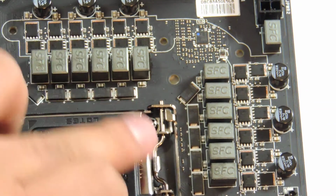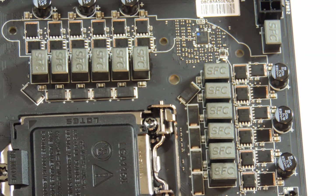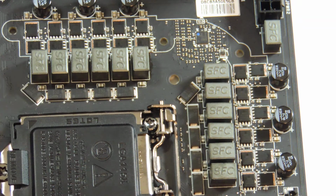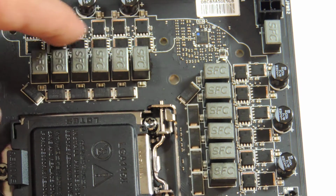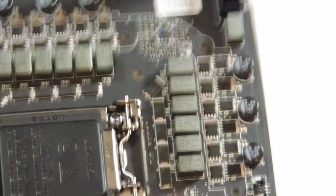What we're dealing with here are power packs. Power packs are in this package. These are from Niko, and you know they make a lot of D-Paks, but these are not D-Paks, and these have all the good qualities of the low RDS(on) power packs. And these are, I believe, the low side is a PK632, which would be the ones closest to the chokes. Ones furthest away are the high side, and those are PK616, I believe. Yes, PK616BA.